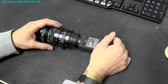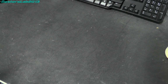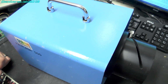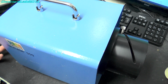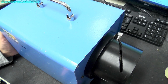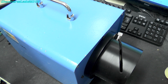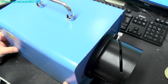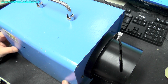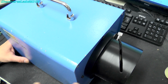So it was back in 2014, 4 years ago. Wow. What I managed to pick up back then was this great big monstrosity, which I can't even get into the camera. There we go. This was a thing that I picked up off eBay. It's actually a PAL Flash 500 and is a very scary 10,000 volt, 12 joule high-speed air-gap flash. And in the right configuration, the flash duration of this can be as short as 500 nanoseconds, so really, really fast. So combining that with an SLR, you can potentially get stills of 2 millionths of a second.